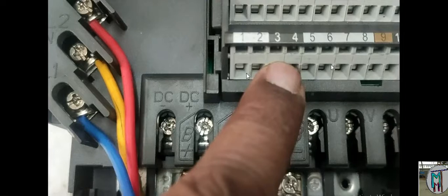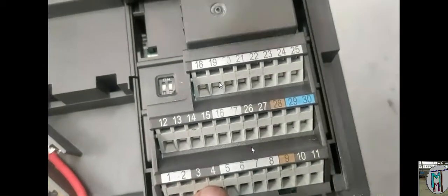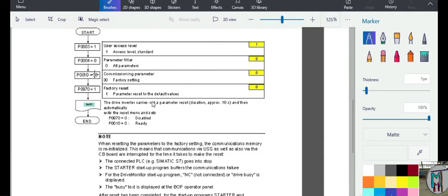We have to fix some wires for our analog input and potentiometer, and we will show you how it will work in manual mode and what the installation procedure is. First we have to check that the input supply has all three phases working correctly. Now we have to go through the factory default first, especially if we have used this drive before. You can download the manual from the internet, or use the manual that came with your drive.